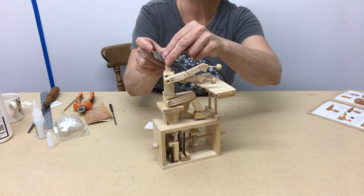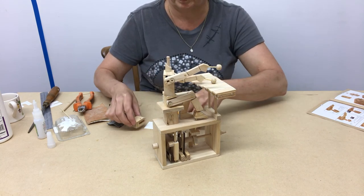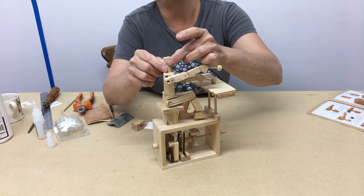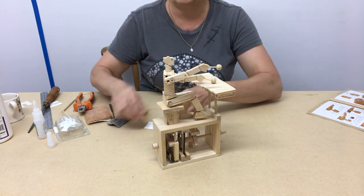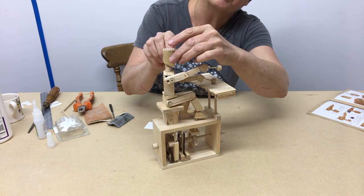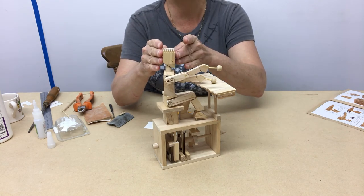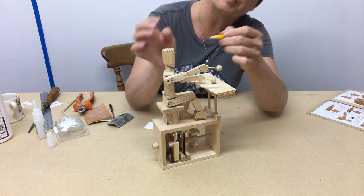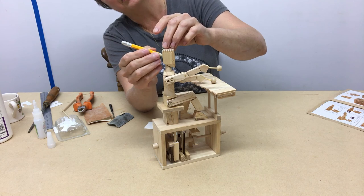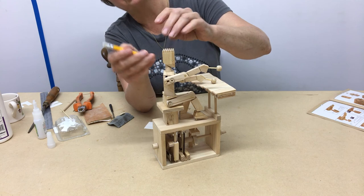You want them to be able to just literally glide across like that. So with this in its lowest position, drop that down until it hits the neck. Then put the head on and push this peg through. The head should be in a vertical position. Then with a very sharp pencil, reach in from the front or the back and mark the position of where the neck tube comes through.